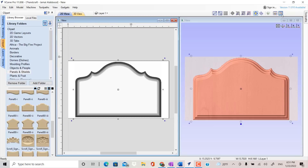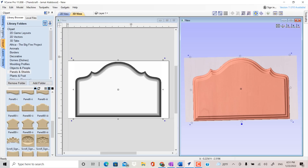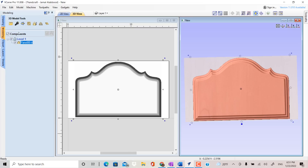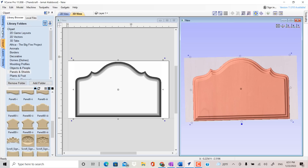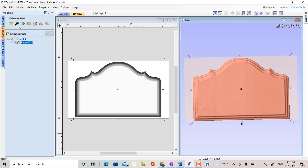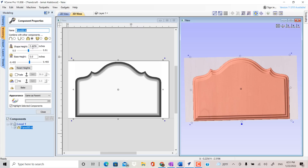It makes it a whole lot easier to see when you view it this way. The first thing I want to do is see the actual thickness of this model. I'm going to select the modeling tool tab and I can see that the shape height on this is 0.5 inch. My total thickness of the plywood is 0.91 inch, so this is a little bit over half the thickness, but I think that will work. We're going to start with this number — it's going to become very important.